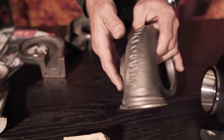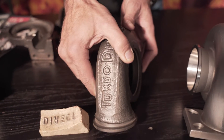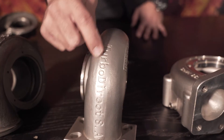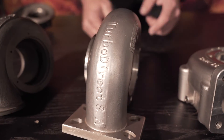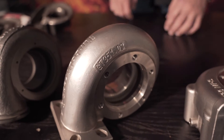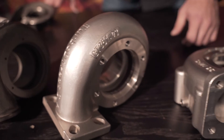You can see there's no porosity. The casting is still very good, although the finish is not that great. Then we progressed to stainless steel. You can still see the inserts are not 100% — you can still see the little labels that we used on the investment cast molds stand out a little bit.